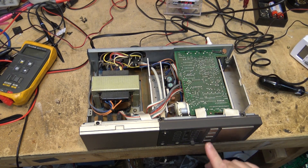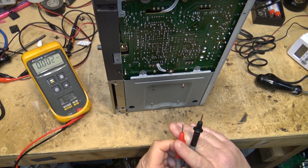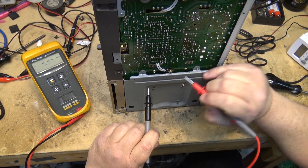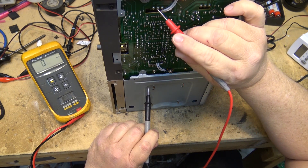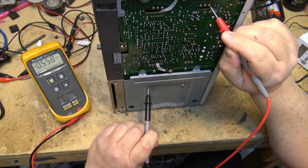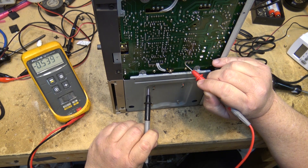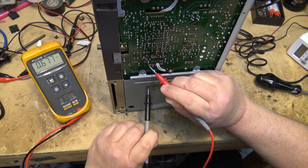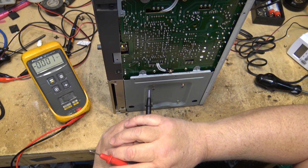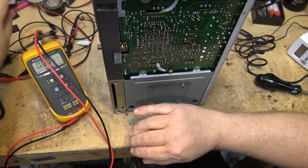There's no sound. First we'll check and see if there's any voltages on the output transistors. I'm measuring 43 volts, minus 43, minus 43, 43, and there's no DC. There's our bias voltages — that is looking okay. Base bias is minus 0.5 and plus 0.6, so we have our bias for the transistors. That part's working. Now we have to look and see if there's a problem in the preamp, but the power amp itself seems to have power.